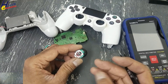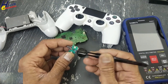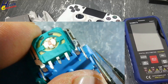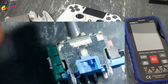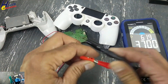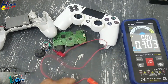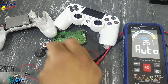This joystick is in three portions: two axis translators, drift sensors, and one micro switch. Here one potentiometer, here is the second potentiometer, and this is the micro switch. Set the multimeter to resistance. I will use mini grabber cables to make it easy for connections.